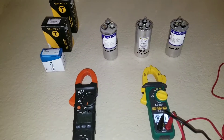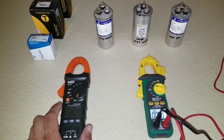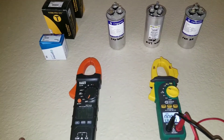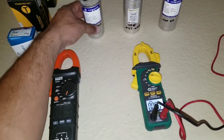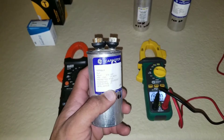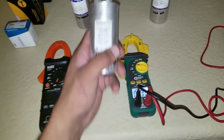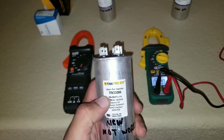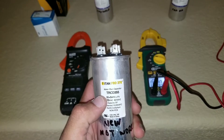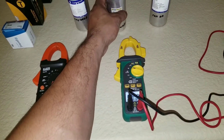When dealing with a capacitor there are a few things you want to consider. First, you want to make sure your multimeter can test for microfarads or MFDs. When you look at these capacitors you're looking for two specific readings — for example, this one is 35 plus 5 microfarads. You need to be able to test those MFDs, because not all multimeters give you that capability.